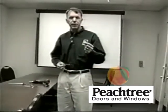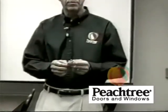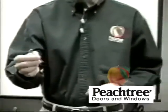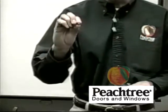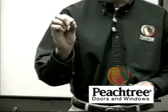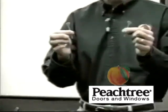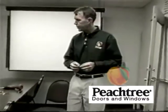A special tool that's needed, and these are obtainable from Peachtree, is an alignment key. We send these out with mortise lock boxes, or we can just send them out in an envelope. It's a small aluminum piece, flat, a little bit larger than 1/8 of an inch wide and about 1/16 of an inch thick. We use 2 of these when synchronizing the lock or installing the hardware in the panel.